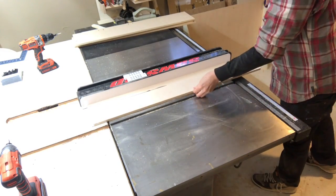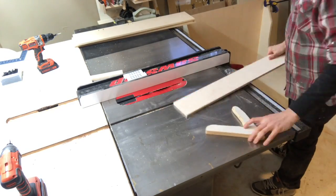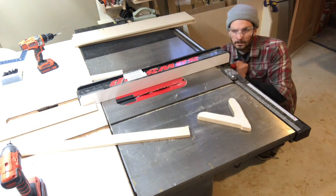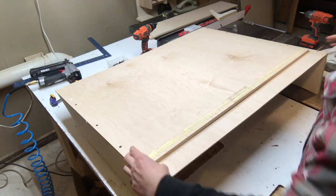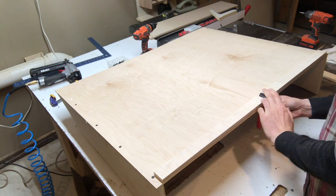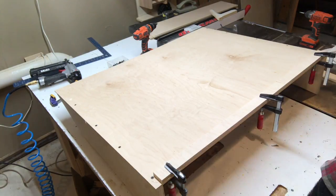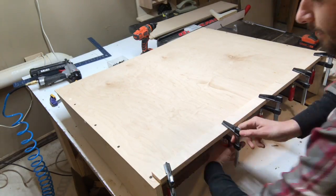The unit's held on the wall with a half-inch thick French cleat. In addition to the two beveled pieces that compose the cleat, we also need a bumper at the bottom to keep the cabinet from swinging on the cleat. The bumper is glued on to the bottom edge and will double as a backing to screw the bottom shelf into — the bottom shelf being the biggest and therefore needing the most support.